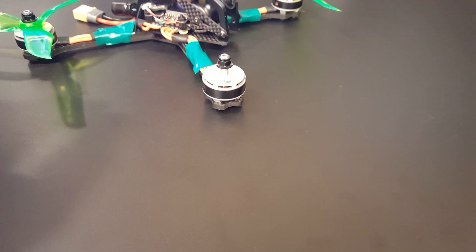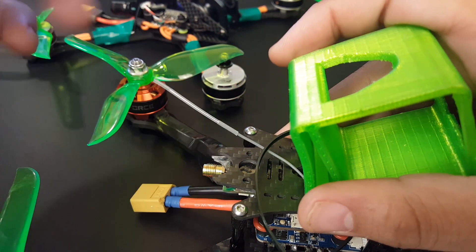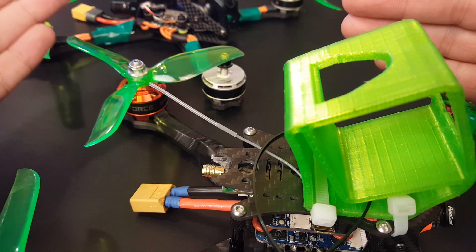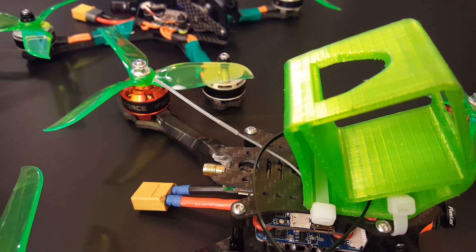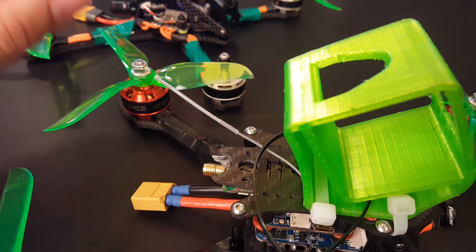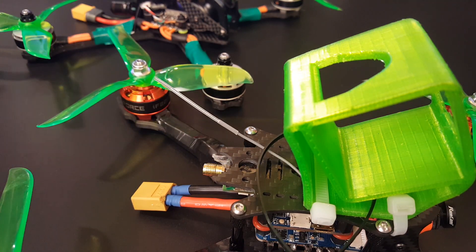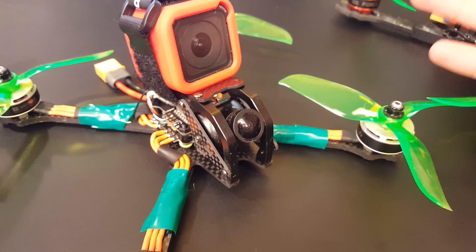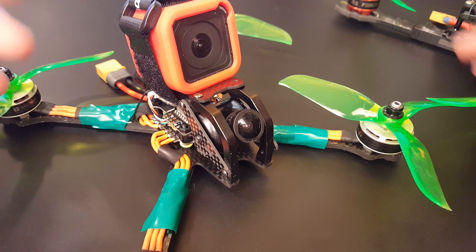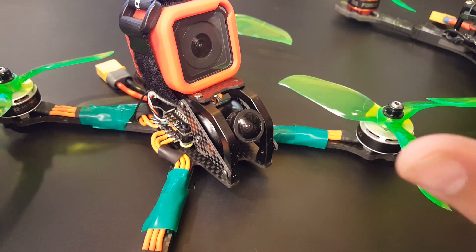Check your SMA or RPSMA port, because these tend to come off, break, or have pins break so they're barely hanging and vibrating — and that vibration is what causes the noise. Easy fix: just re-solder it or change it out. This happens to me a lot. Thoroughly check your SMA port — don't just look at it, try to move it. If you have another VTX, try swapping it in. 99% of the time that's the issue, and it's helped a lot of people.